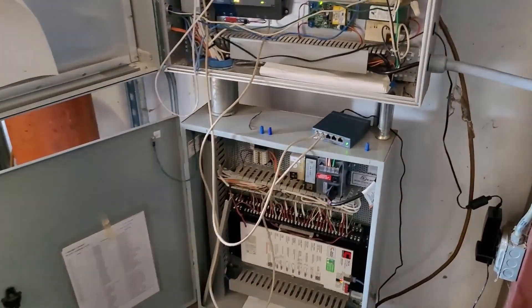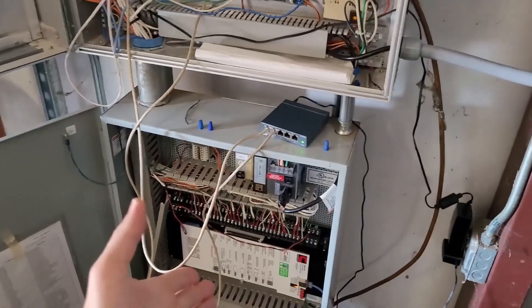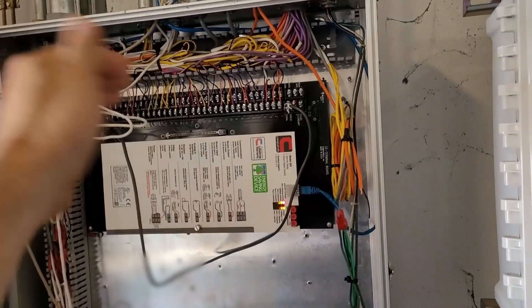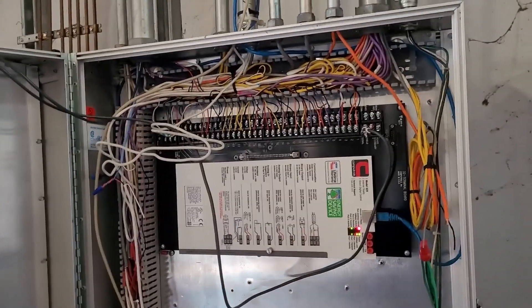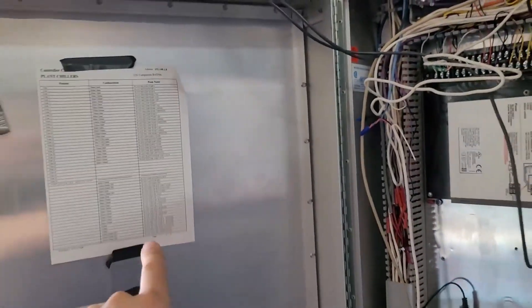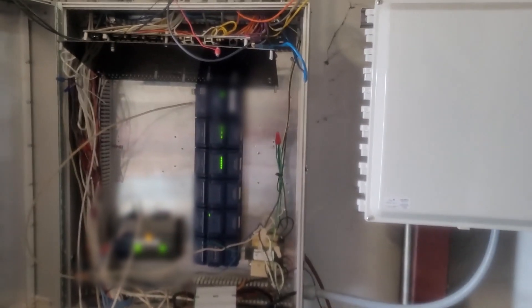Once the plant is reliably running in hand and the ECY is installed, I know that almost 58 of these points will come into this area. Some wires up here will need to be lengthened, and those down below will certainly need to be extended and brought up — all done neatly and tied together. A good idea is also to pull the wires forward and start labeling them according to the points list. The ECY is 21 inches long so I had to move the old controller out of the way to mount it and give it an Ethernet connection.